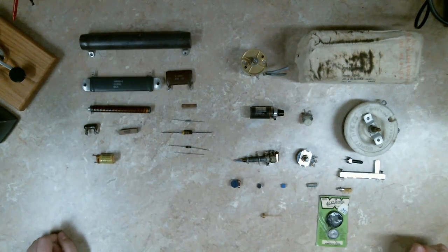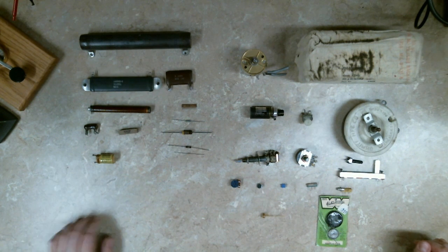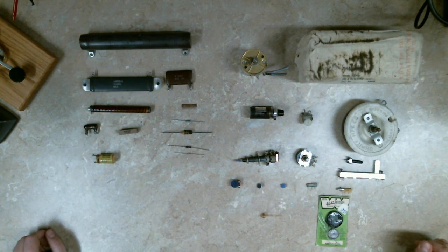That's pretty much all the common types of fixed resistors you're going to run across. All of these have a set value that can't be changed, at least not through normal means. There are many more types, but this covers most of what you'll find from the 1960s through current technology. It doesn't cover surface mount — probably most circuitry people are doing now is surface mount. And for a lot of microcontroller work, you don't even need the resistors because the chips have them built in.